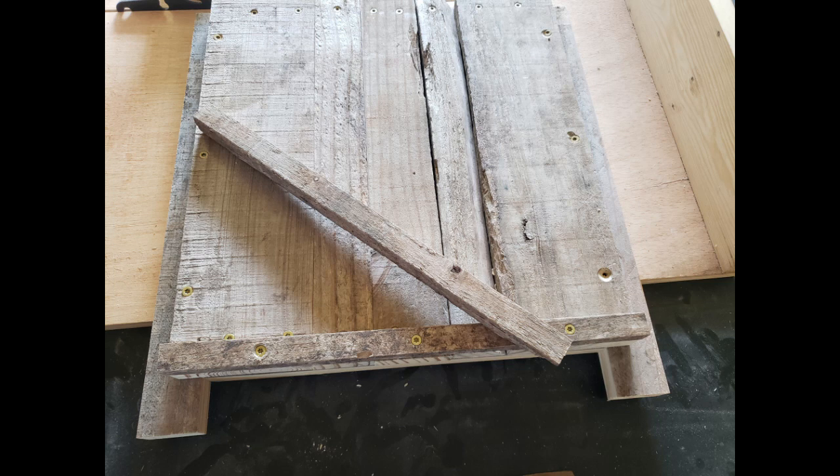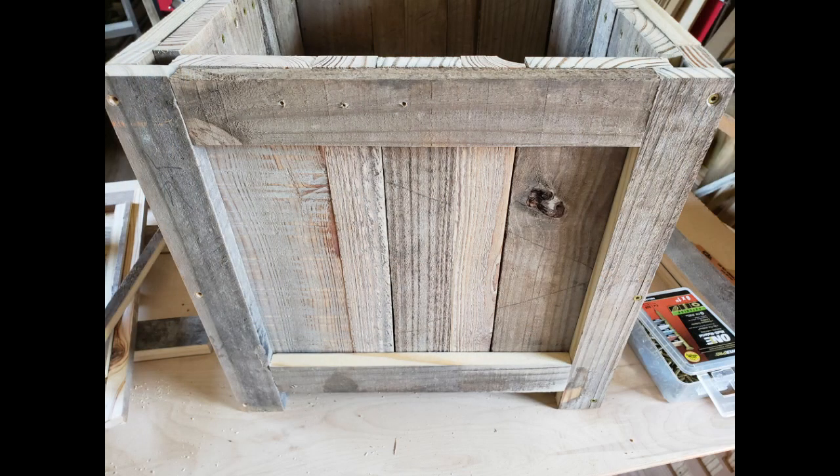Another difference in this build is that before I put the planter together, I'm putting these cutoff pieces — from those wider boards where I trimmed down to exactly 12 inches — I'm putting three screws to hold these down at the bottom, which is going to hold the slats that I'm going to put inside the planter. This is actually going to have full slats across the entire bottom, then plastic, and then dirt through the whole thing. And here's the planter assembled, identical to the way Matthew Peach did his — drill, countersink, screws on the outside boards, that would be the A pieces.